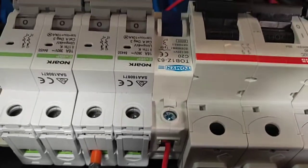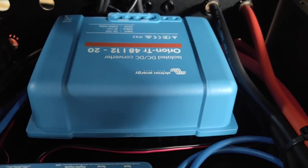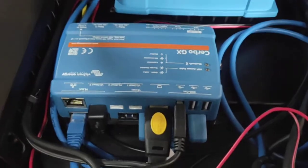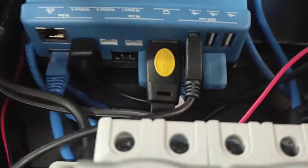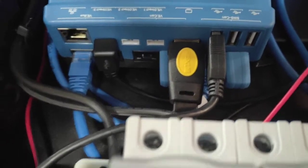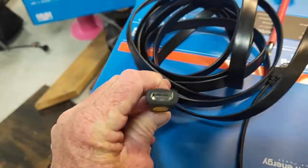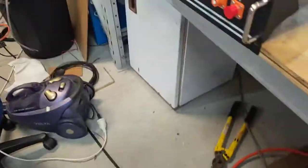Each positive goes to its own little circuit breaker. The other little blue-colored circuit breaker there in between, with the red wire hanging out, is a circuit breaker for the Orion 48 to 12 volt converter. The other thing inside the box is the Cerbo GX, and you can see the plug there with the yellow mark — that is your HDMI lead coming out here.